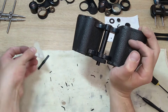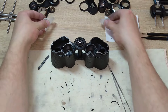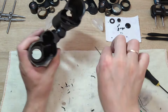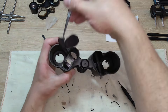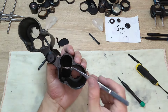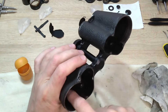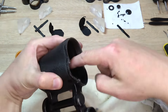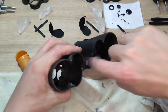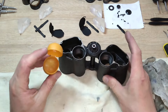We carefully take out each prism and place it in the correct spot so that we don't mix anything up later. From this side, carefully take out the anti-glare covers to avoid scratching the optics, and we also carefully place the prisms in the correct and precise position. Next, I first carefully wash the body, treat it with alcohol, and then gently apply a very thin layer of oil. I do this so that when very small particles of dust get in, they do not settle on the optics itself but instead stick to the body of the binoculars.